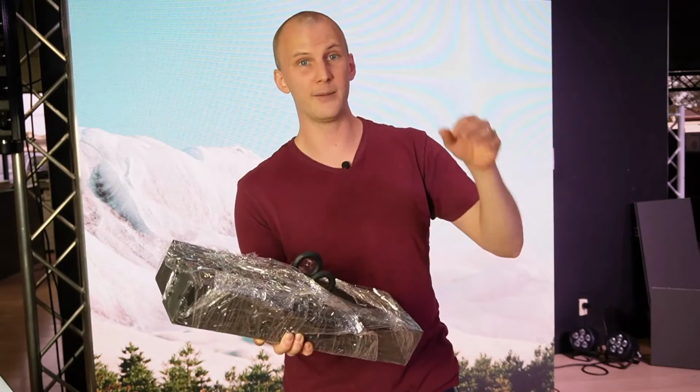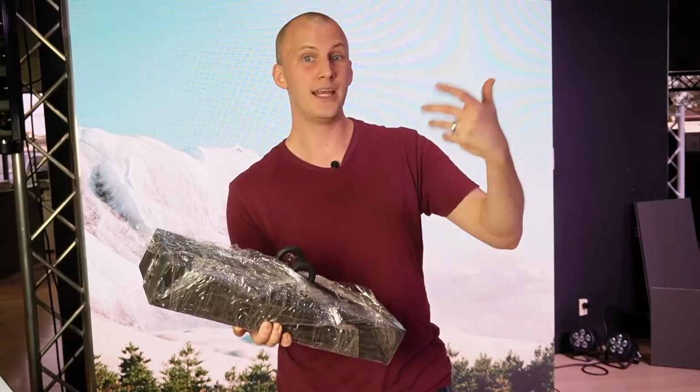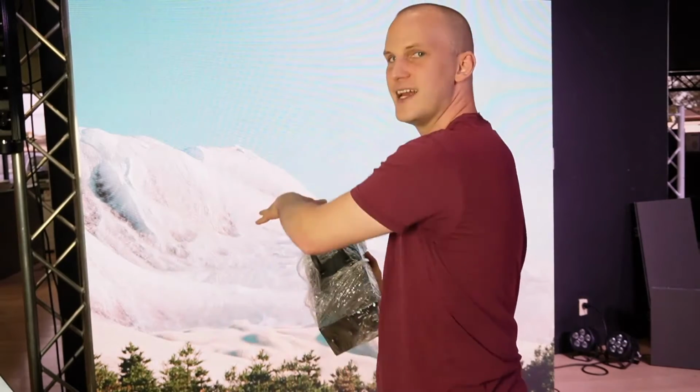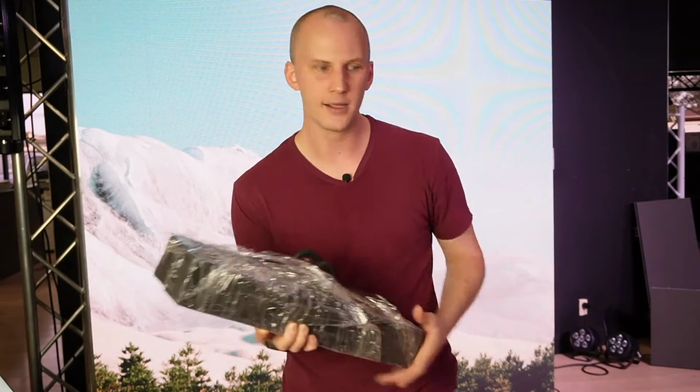And that can be great in a permanent installation. But if you're portable, if you're setting it up and tearing it down, then that's probably not the route to go. You're going to want to go ground stacked, which you can easily do yourself, or you can go with the hanging bars. Again, making sure that if you're hanging it, you're either using some sort of truss structure that's ground supported and rated for the weight that you're going to hang, or you hang it from a truss or a beam or what have you that will support the weight of the wall.